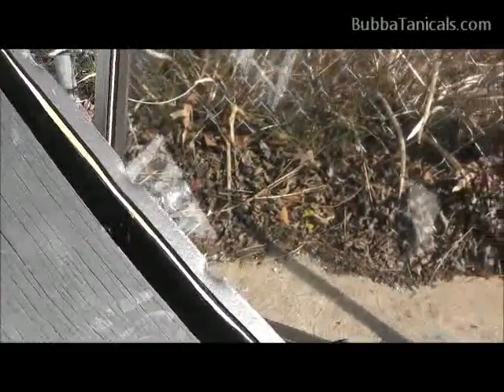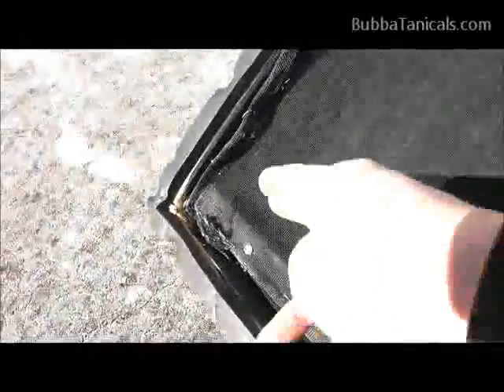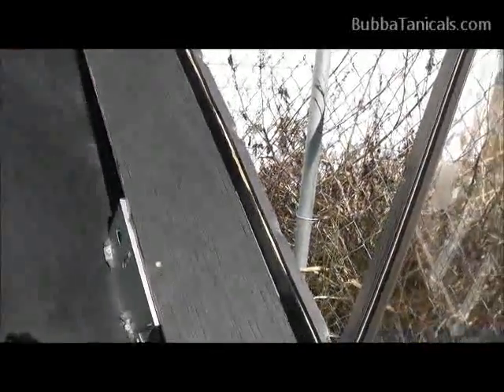Around the unit there's three-quarter-inch foam rubber weather stripping stapled toward the outside, which overlaps the gap along the inside of the window frame — it goes all the way around. A good seal is really important since you're blowing house air in and want it to come back into the house. The one exception is a small water leakage issue, handled by a couple of quarter-inch holes drilled along the bottom so water can seep out as needed, but the air loss there is negligible.